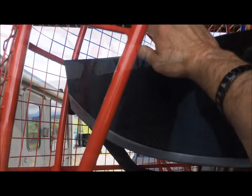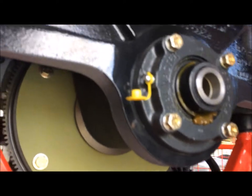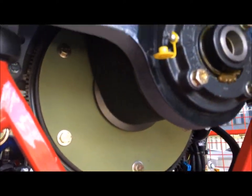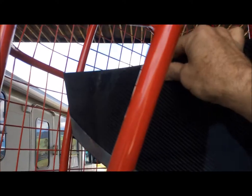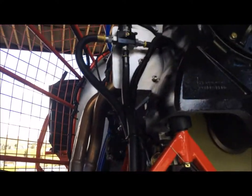Then you probably won't have to set it for 40 or 50 hours. Just take and move the tip of the propeller — if it goes back and forth, you'll see the belt underneath is also moving just a little bit. That's the signal that means you have to adjust with these bolts here.